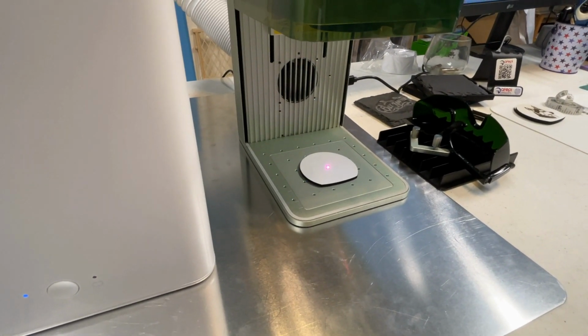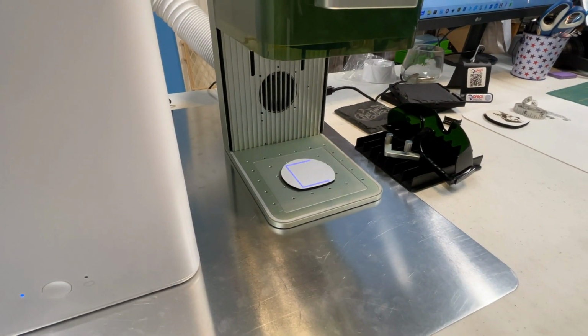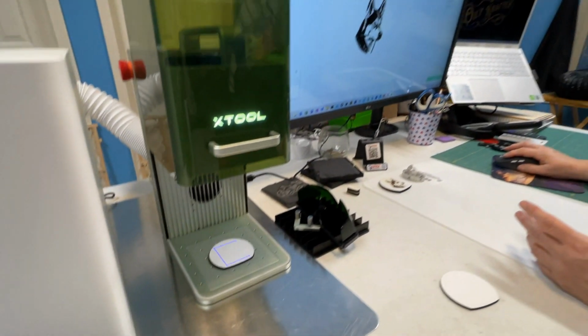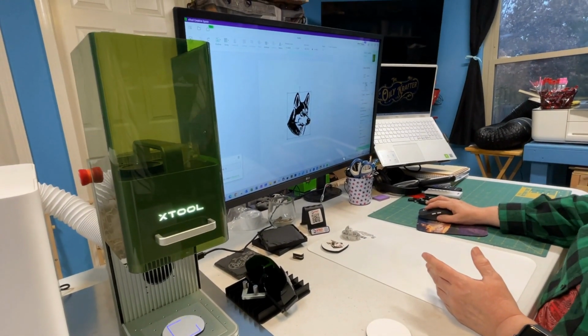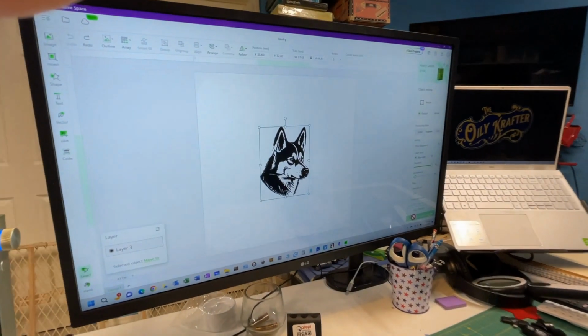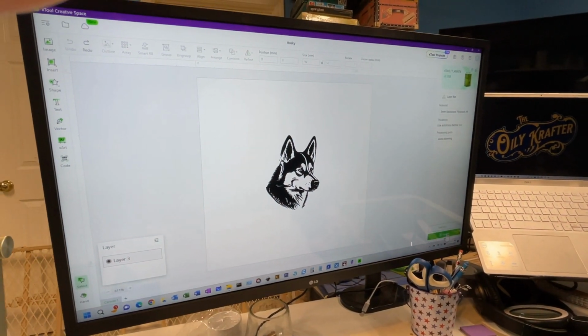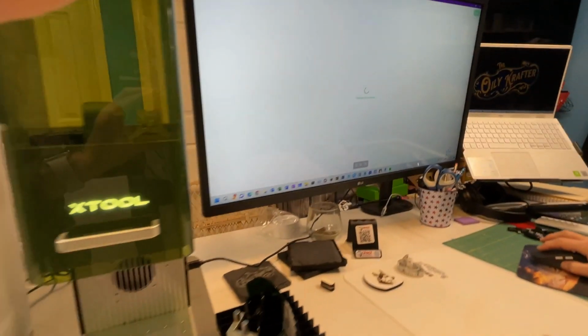Stop framing. Since I hit the back button, it didn't know what to do. Okay, so now I still have my settings at the 3 millimeter basswood. I'm gonna go back in here and make sure it didn't lose any other stuff. Okay, we got the output, the engrave, my settings here, all the same. I'm gonna tell it to stop framing. All right, now I'm gonna hit process.